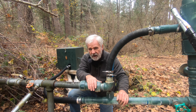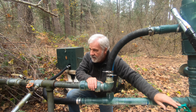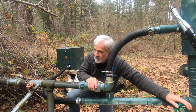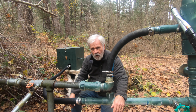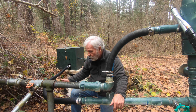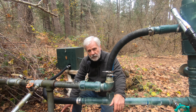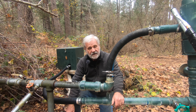Let's see what happens. Oh, I like that sound. Sweet. The water has gone in through the black pipe, drives the Pelton wheel, turns the alternator, generates electricity, and the water is discharged out the bottom back into the creek — sort of a complete cycle. Now we have electricity until April, when the sun is again high enough in the sky that I can switch back to solar.